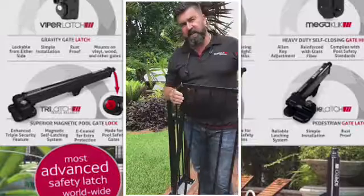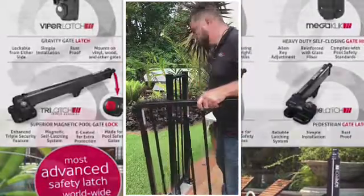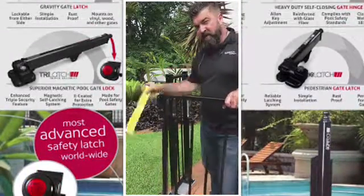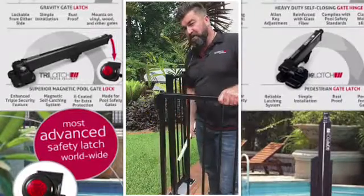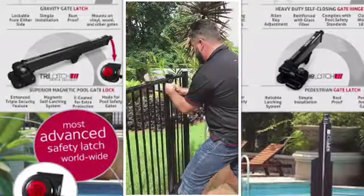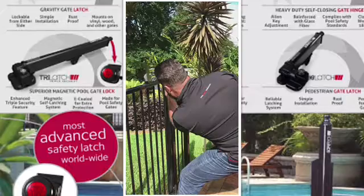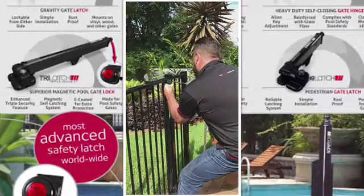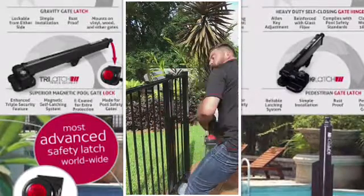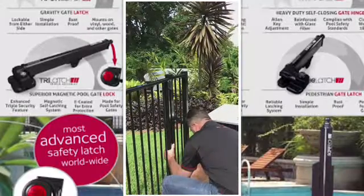Okay guys, you'll notice on these G90 hinges, they have legs, so they're self-aligning, providing my post is level and the counterpost is level, we should be right. I'm going to take the gate, simply hold it up against the post using my eye. Screw that off. It's a one-man operation. I then go to the bottom, do exactly the same.